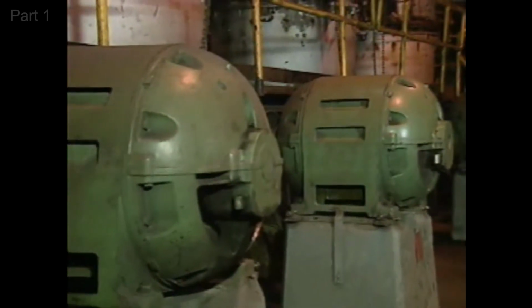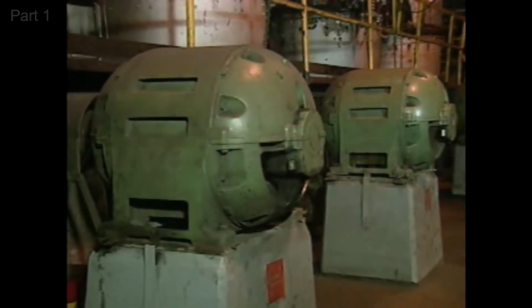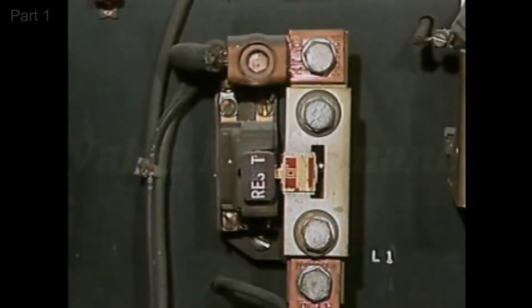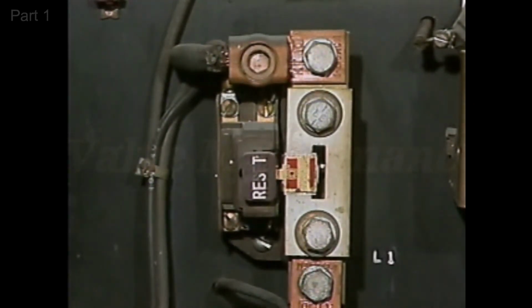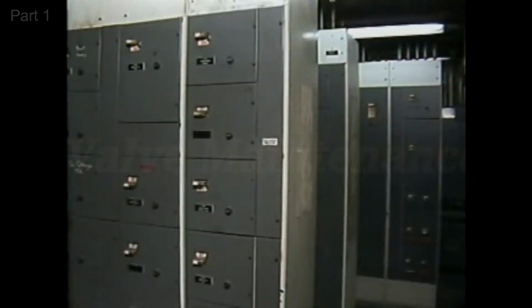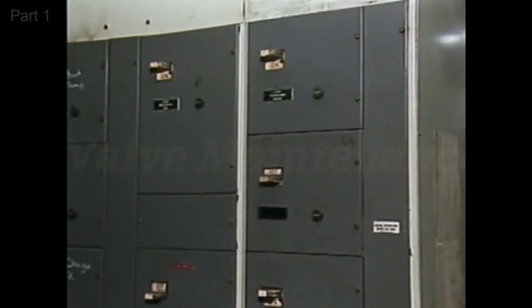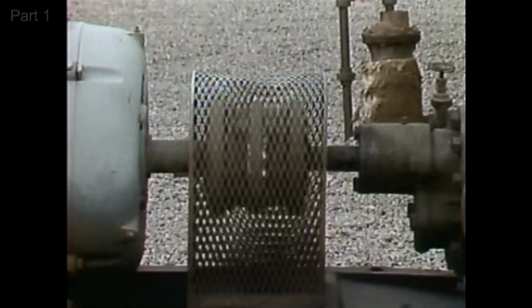Motors are rated to deliver a certain amount of power. If demand on the motor increases, current flow through the motor increases. If the current is allowed to exceed the rated capacity of the motor, it can cause serious damage to the motor's windings. To prevent such damage from occurring, overload devices are installed in most AC motor controllers to protect the motors from excessive current. Whenever an excessive current condition occurs, an overload device opens the circuit that supplies power to the M coil in the controller's contactor. The de-energized M coil opens contacts in the motor controller, interrupting current flow to the motor, and the motor stops.